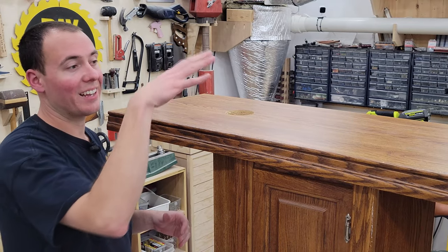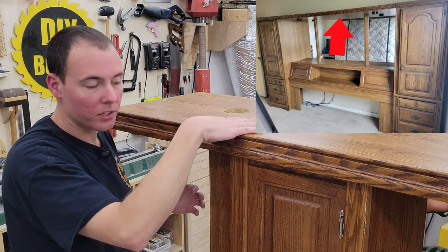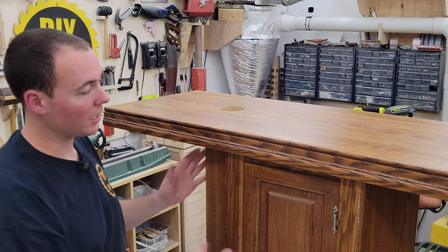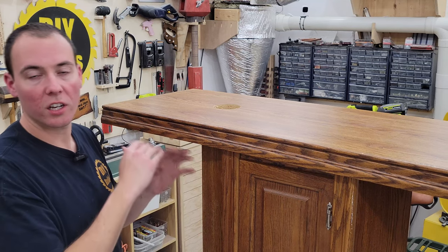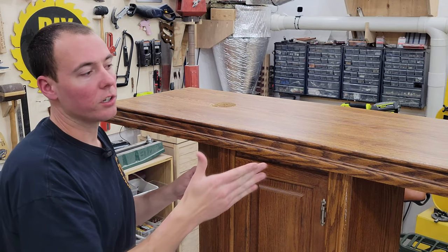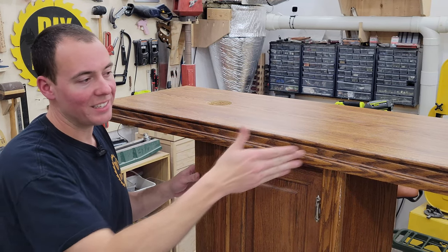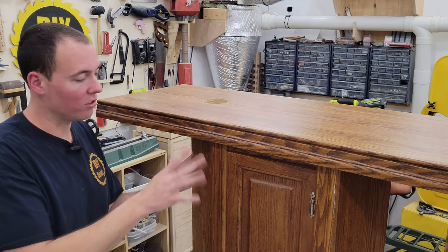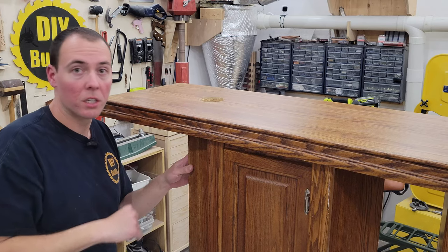To round off the top of these end tables, I have this upper piece which used to have the lights shining down, and we've got it flipped upside down to be our nice top. We have kind of a weird angle on the front, and to make the angles work along both sides, I'm just going to use a straight edge between the two pieces, draw a line underneath, and cut that with a circular saw — no fussing around with weird angles. You might be wondering what I'm going to do about trim on this side — am I going to miter it or anything? No, I'm just going to leave the end cut like that, because this is just going to dead end into the mattress of the bed, so I'm not really going to worry about it. I think it'll look just fine, and that little triangular piece hanging over the end is just extra storage on the tabletop. Whatever — it was free.